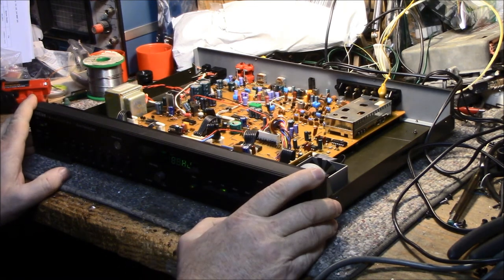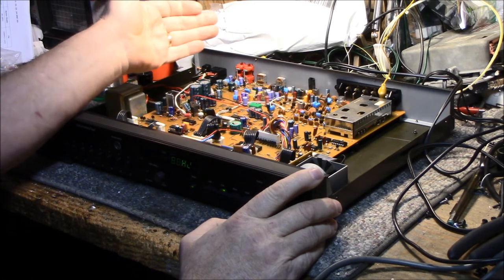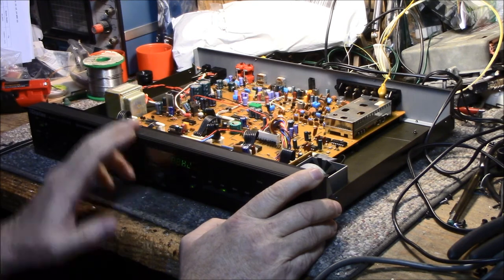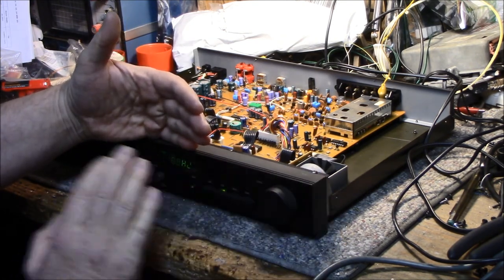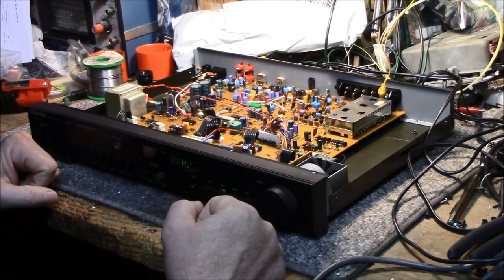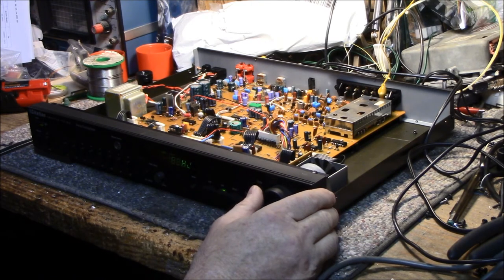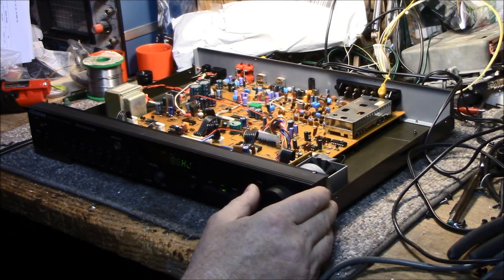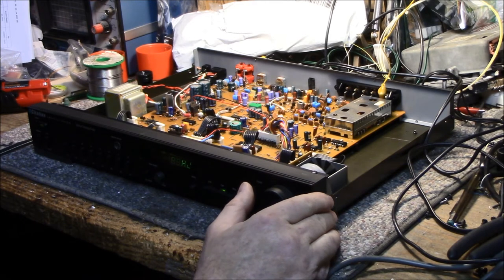Okay, I've gone about as far as I can with this tuner. I've got the output jacks replaced, about 10 caps replaced, and the incandescent bulb replaced with an LED — current dropped to 25 milliamps and it's still bright enough. Overall it's a nice tuner, though it does have some flaws. For example, when you tune it the dial bounces back when you let go of the knob — I think the weighted shaft isn't balanced properly. It distracts from tuning in a station and just wants to do its own thing, which is a big fail for me.